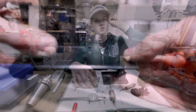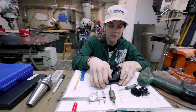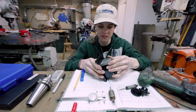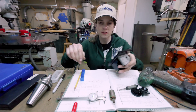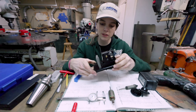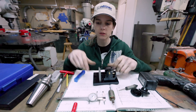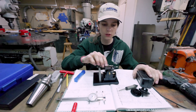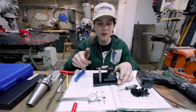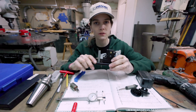Fitment test time — see if it goes on. That is actually a fairly snug fit. Remember what I said about having a little bit of wiggle room? Absolutely perfect. That is such a nice, snug fit. My bolt hole lines up absolutely perfectly. It's a little bit tight, but I'm perfectly okay with that. And the armature sits in it nicely, spins really nice — no binding at all, which is fantastic. All I have to do now is make a block to take up this gap here. Shouldn't be too bad — just going to be a block of aluminum with a couple holes in it.